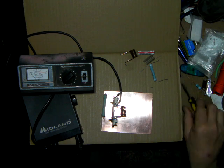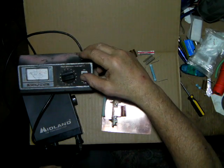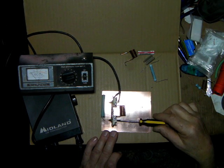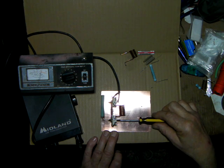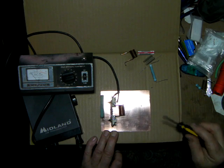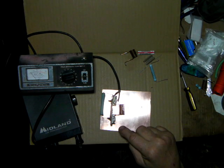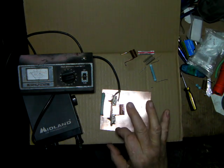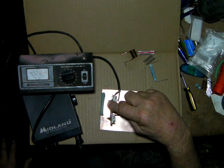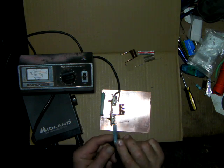I've got this one zeroed out — we'll set our SWR meter. There it goes up. Zero it right down to zero SWR. The measurements that I have printed are what this cap would measure if we just disconnected everything from it and tested it with a capacitance meter. Now I'm going to show you how little difference there is between this 470 ohm and the one I'm currently going to use, which is a 619 ohm.